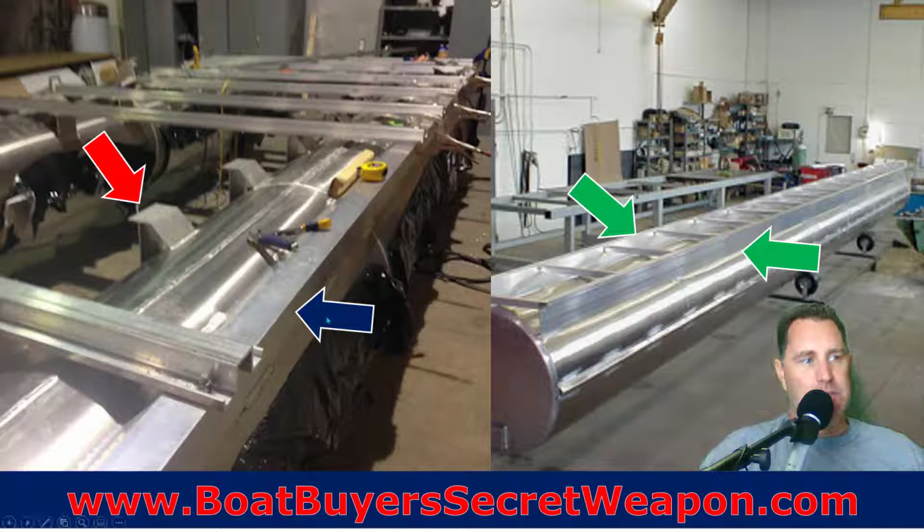Once we get to the tubes, we talked about putting those risers on. Some of them, they call an M bracket because they kind of look like an M shape. And that's going to allow you to put the cross members on, all right? So we're going from a round surface to a flat surface so we can put the cross members on. There are 3 ways they do the risers. The first is a riser that's just a single riser. It's going to take a single beam.